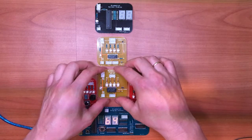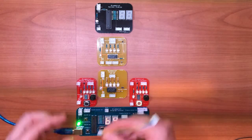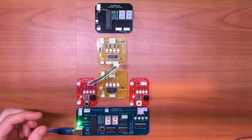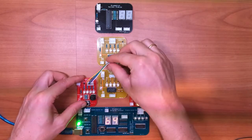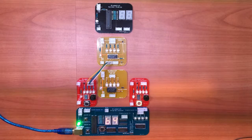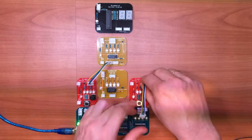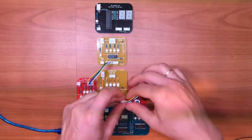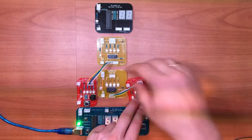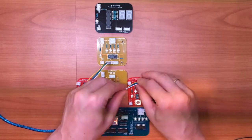What we start with is we wire up our setup as yesterday, and for example today I start with the data wires. Data from the first manual programmer is going to the adder, and the data from the second manual programmer, and that's different to the setup we had in the second tutorial, is going here into the inverter. All right, so that's the number we want to subtract.